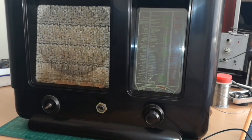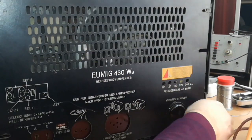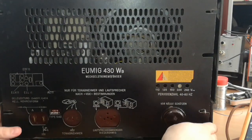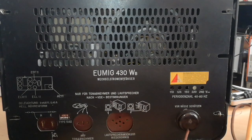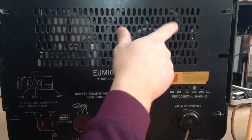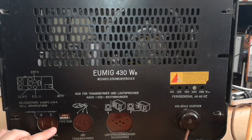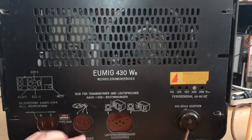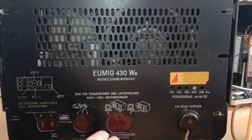Before I continue checking for the issue, I will show you now the back cover so you can see what's on the backside of this radio. So this is it. On the backside there are already quite a few interesting things. You can see an extremely large loudspeaker — we will see if it has a permanent magnet or electromagnet. Here as usual we have antenna and earth or grounding for this radio. This is the input for the gramophone and this is the output for external loudspeakers.